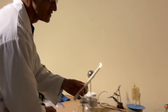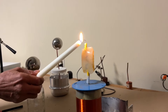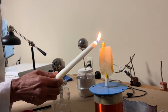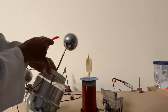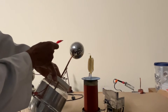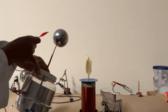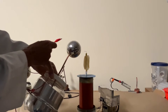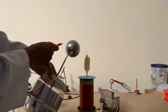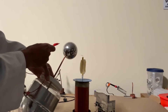Now let's try another experiment to see if it'll blow this flame. I'm going to put it right near the output of the Tesla coil and see if it blows the flame. As you can see there, it's blowing that flame. So what I have here is a Leyden jar consisting of a plastic bottle with aluminum foil on the inside and outside, and I'm spraying charge onto the Leyden jar to show that charge is building up on the jar. That's charge building up from the Tesla coil, proving that it's producing a DC jet.